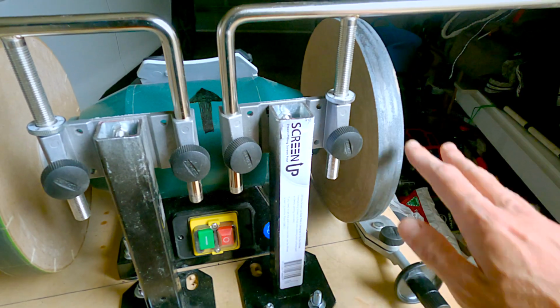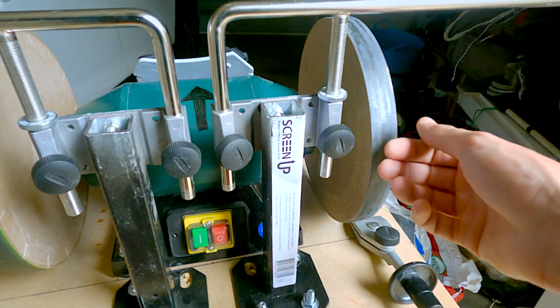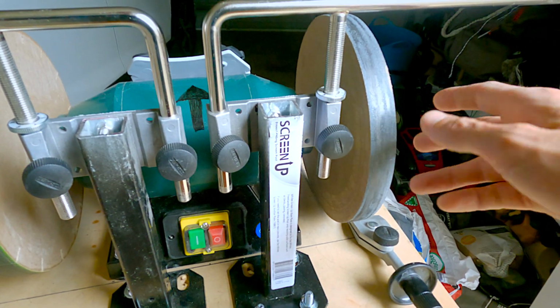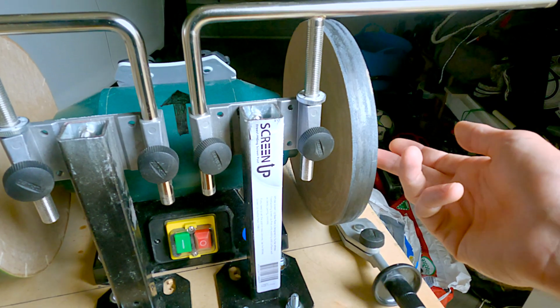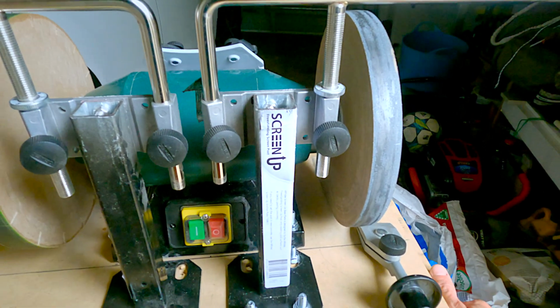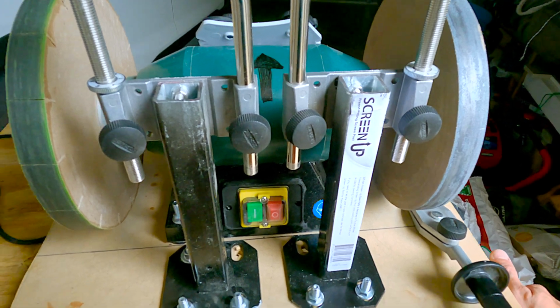So first you need to remove the grit, which is super hard, and then you gotta slowly remove the paper wheel material itself with, I don't know, 40 grit sandpaper, and you need a lot of that. And you gotta use a vacuum, otherwise you're gonna end up with a massive garage cleanup. It's a lot of dust, and without a vacuum, don't bother.